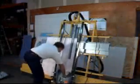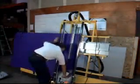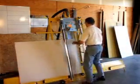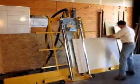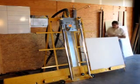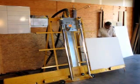The razor knife is used for softer materials like foam board and coroplast. The pivoting razor knife can also be used for score cutting drywall. Once you make your score cut, you bend the material, then cut the backing paper and cut the material free.